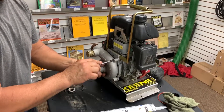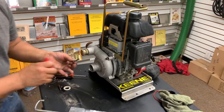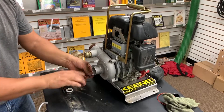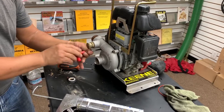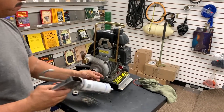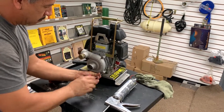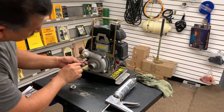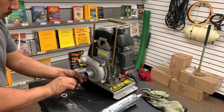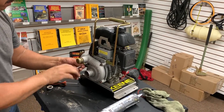People don't realize that these pumps spin up pretty fast — I think this pump turns at close to 7,500 RPMs, and that's why you get that extreme pressure out of a little pump. I really do like this pump. It does close to 100 gallons a minute, has about 160 foot of head, and extreme pressure. A pump like this will outperform most three and four horsepower pumps, especially semi-trash pumps or imports. This thing is built to the hilt — high performance with tight tolerances and really super high performance.